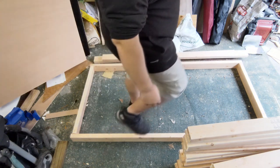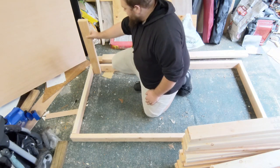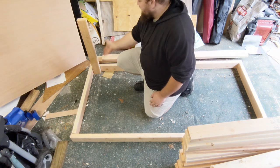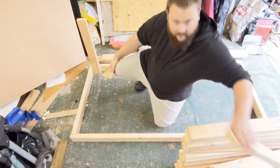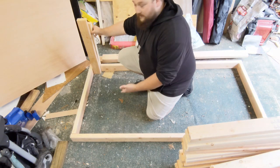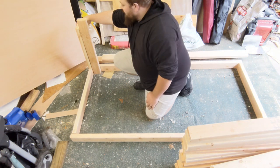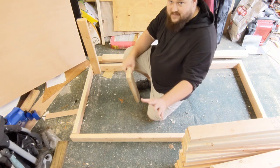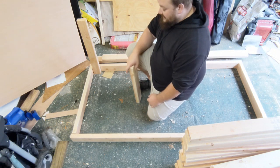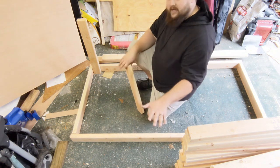The stand is going to be 27 inches tall, so you're going to have 27-inch uprights in the corners, and then your top frame is going to attach there — same as the bottom one does. Then you're going to have 20-inch supports on the back side, transferring the weight from the top frame to the bottom frame, as well as on the sides. That's going to be your main load bearing. And then every 2 feet you want to have a vertical support for good support of an aquarium.